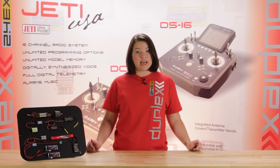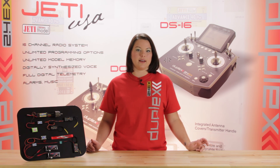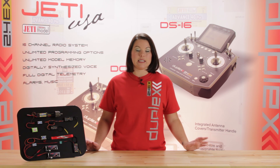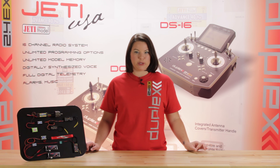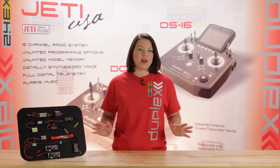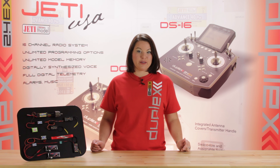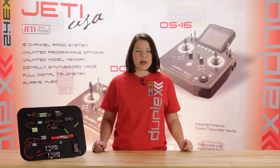Both the DSM-10 and the DSM-ESC are designed for two independent 5 to 13 volt inputs and support up to 10 amps continuous current or 20 amps burst current. These work great with today's high load servos, which you might be operating directly from a two-cell lithium ferrite or similar lithium polymer battery pack.